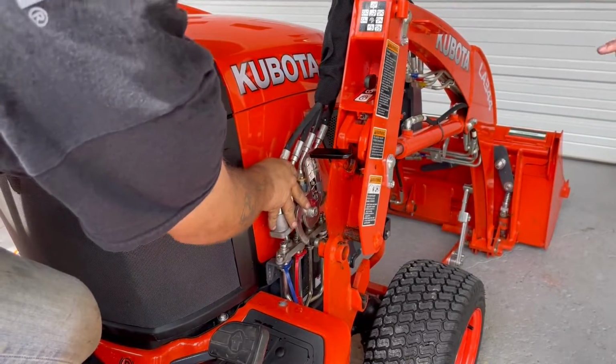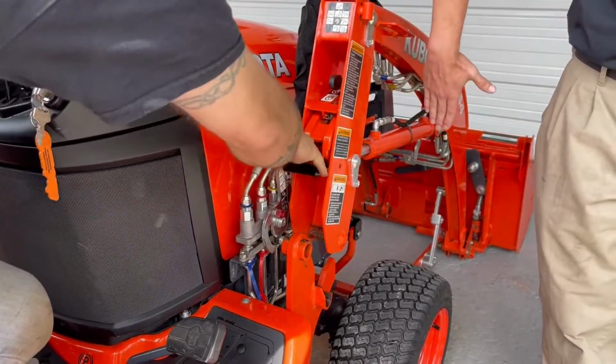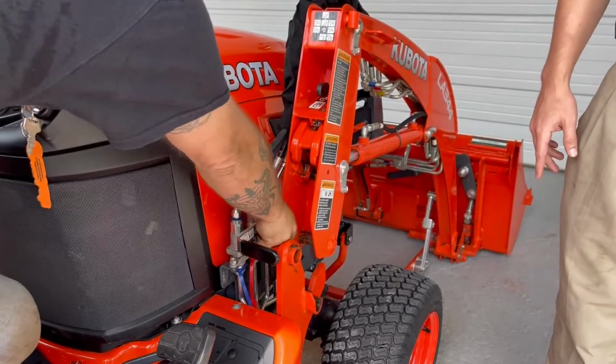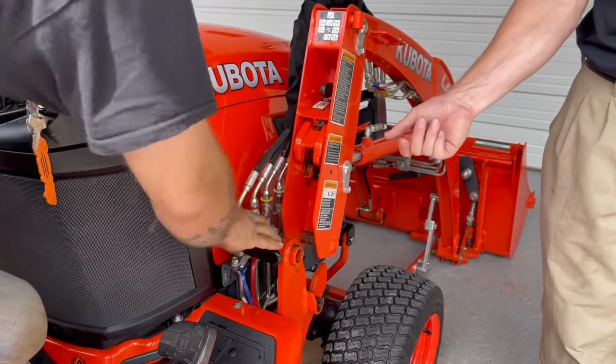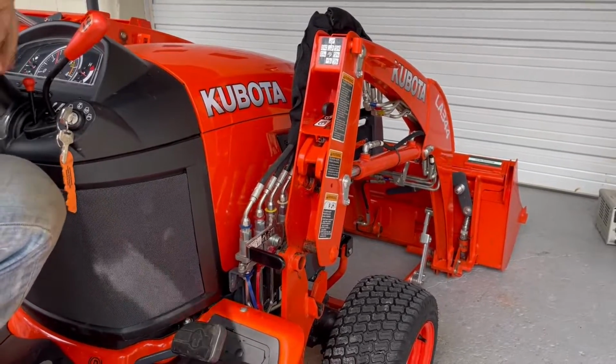and it is a little easier if you actually, before you disconnect your hydraulics, pull this piece forward a little bit, but you can still get to it. You lock it in, you put your little red piece back to lock it together. Now those are flat face couplers. You should have no hydraulic leakage in it.